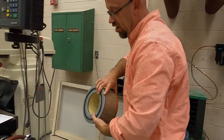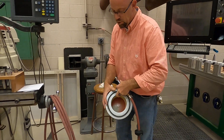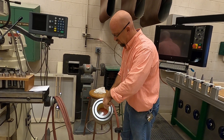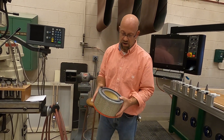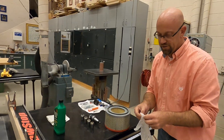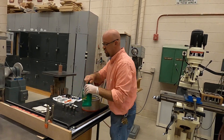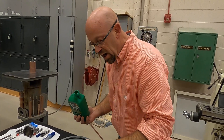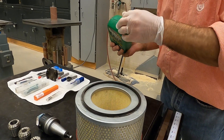Now I'm going to take a little bit of compressed air and blow this out from the inside to blow the dust out. We'll need to do this about once a week. Now you can see this gasket here — this should be conditioned once a week as well. I've brought out the good old Quaker State, and all I need to do is put a little bit of motor oil on that surface. That's going to take care of conditioning the seal.